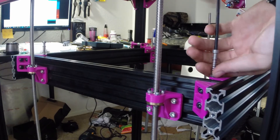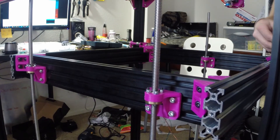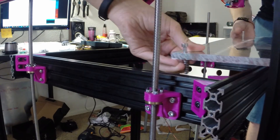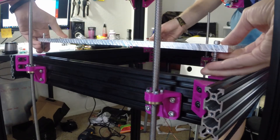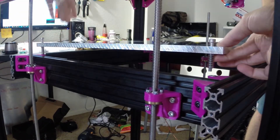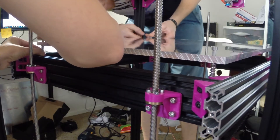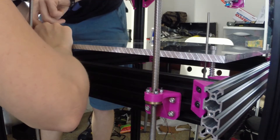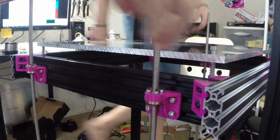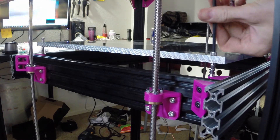These are the leveling spring attachment screws for the Z-bed. Now we can slide the bed itself into place, and here you can also see how the three lead screws will attach to the floating gantry. I'm trying to keep the springs and washers all in place while I move. You can see how that M5 screw goes all the way through the print bed and down into the 3D printed brackets on the aluminum extrusion. That spring in between allows for tension leveling — or tramming — of the whole bed, so I can fine-tune how close it is to the hot end, since the hot end is fixed to the top bar as part of the Core XY kinematic system.